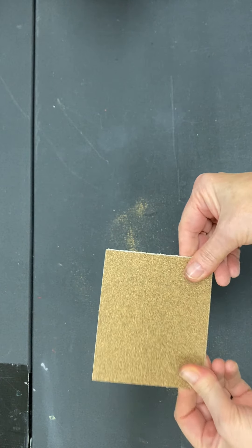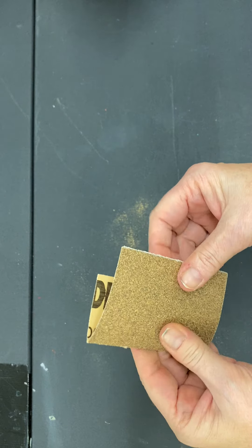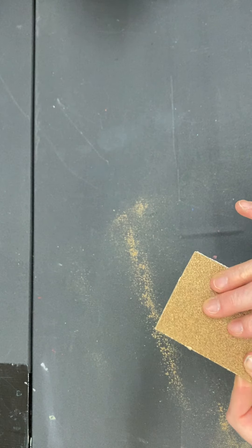There's one more type of sandpaper — it's a really rough, heavy, coarse sandpaper. This is really good if your chair has a heavy coat of paint on it; this is good to try to get that off. You don't have to get all the paint off the chair — you just have to get it dull enough that you can prime it.